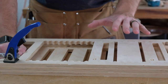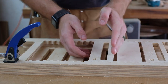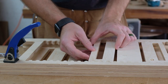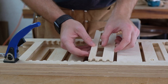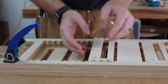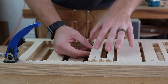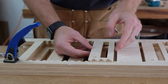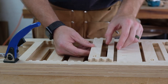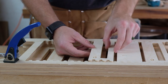I just made those first cuts and I already made a mistake — but that's okay, it'll just alter the design slightly. For insert D, I had it in the right spot but was supposed to have it the other way around, with the fatter side on this side. Each insert has two offsets and you can reference off either one, so there are eight inserts each with two offsets for 16 different offsets, each in a sixteenth of an inch increment. So the mistake is just going to move the vertical divider on the right side over a little bit.